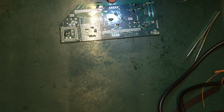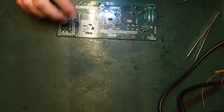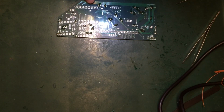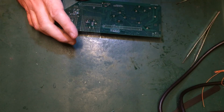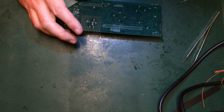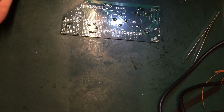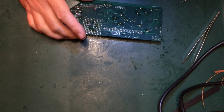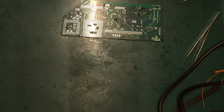These ones down here are for the LED displays. So they're nominally 1 kilo ohm. 680 would do. Depends how bright you like your LEDs. I just want to see that activity is occurring when I'm expecting it to. So they're more just for indication. Once you've got the keyboard in place, you can't see them anymore anyway, so that's a bit of a waste in that case. Right, so let's get on with the 1Ks.